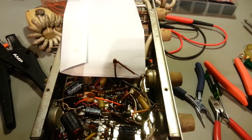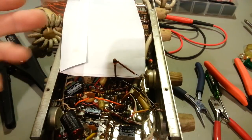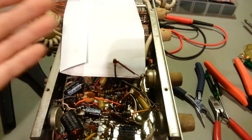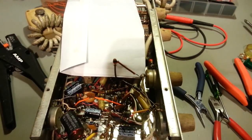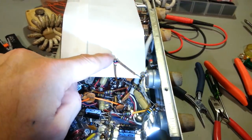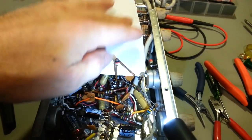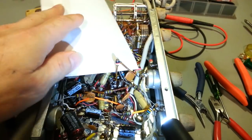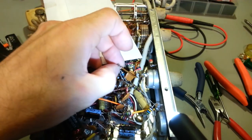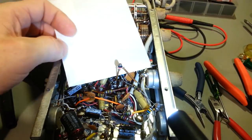But like I say, I'm looking, and then I got to looking, and I was like, wait a minute, there's supposed to be a non-polarized capacitor going from, let's say, point A to point B. I get to looking in this thing, and that's actually what these are. These are non-polarized capacitors that look like epoxy dipped. And you can see there's another one there. They're all over the place. There's another one down here. They have a band that continues down along the edge there that would make it look like it would indicate the polarity.